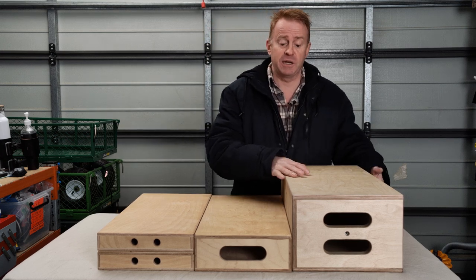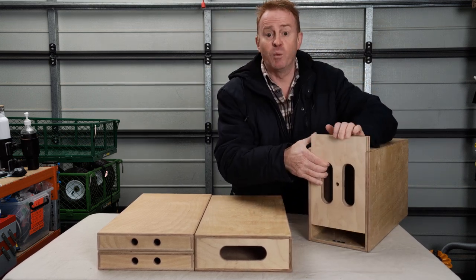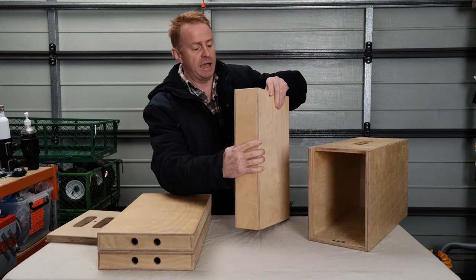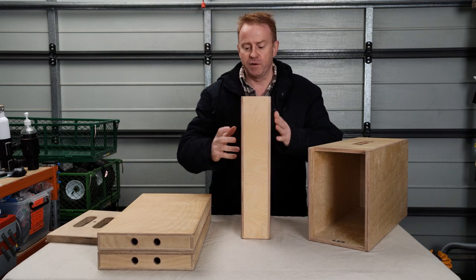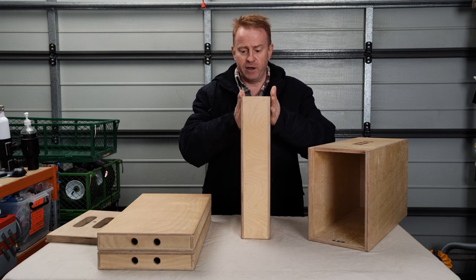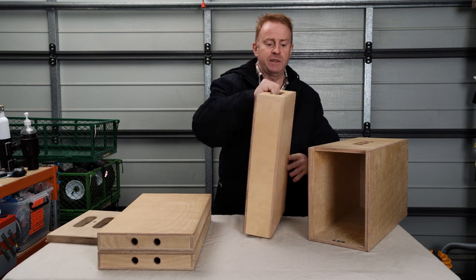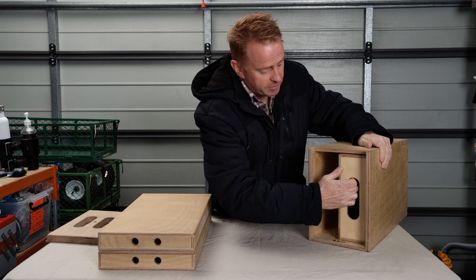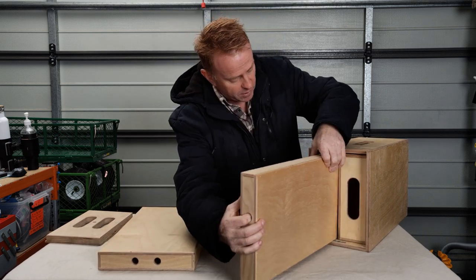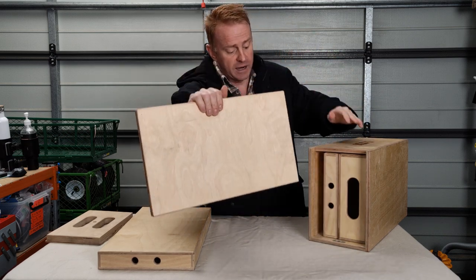Here's the next thing you've got to be careful of with nested apple boxes — not just these but any of them. A colleague of mine gave me warning about this before I fell into the same trap: how you varnish or coat them. I've just got a spray-on lacquer which doesn't add much volume, but if you varnish these up like a normal box they'd be a couple of millimeters thicker each box, and then they won't fit back in the larger box. So be careful of how you varnish them.